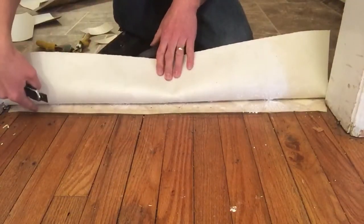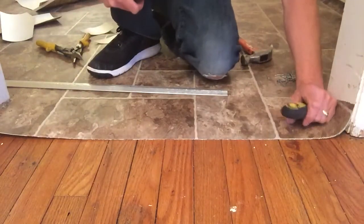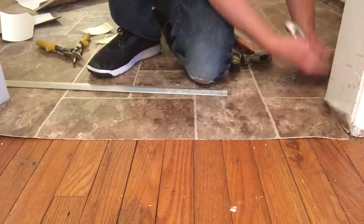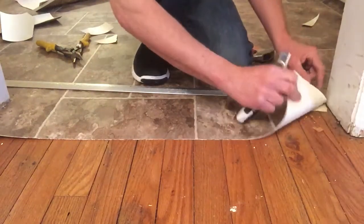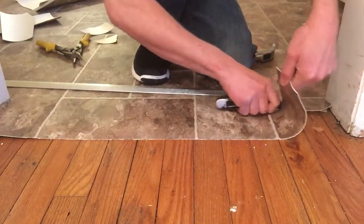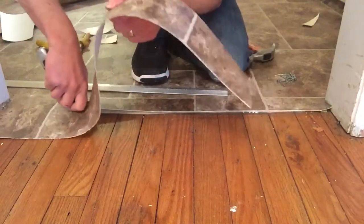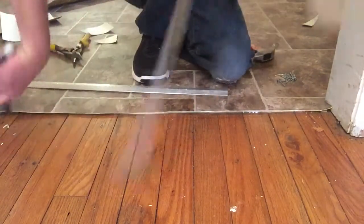You can see the old vinyl floor under here, and I'm gonna trace to that just so there's no existing bumps exposed or anything. I'm gonna use my hook knife — I'm gonna crease to the side there so I get a nice clean cut — and then I'm gonna trace the existing floor under that. The beauty about this is your cut doesn't have to be perfect because I'm gonna be using an inch and a quarter metal to make the finished transition on this one.